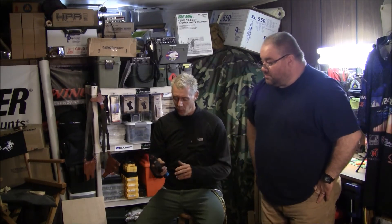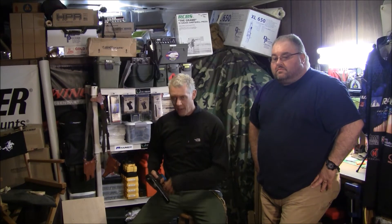We took a little bit more pre-travel out. He wanted to have it in the sub two pound range, and we were able to get it sitting safely right at two pounds, which is right about where I recommend any Glock. If you're going to take it down, even to 1.75, you get into a point where you're going to have to do a little bit more maintenance than you really want to. With him running this compensator and the way his springs are set up, two pounds and the trigger design I have for him — because he specifically shoots steel — just gave it a nice rolling, semi-rolling break and a very quick reset. It came out beautiful.